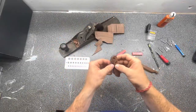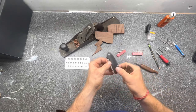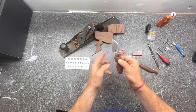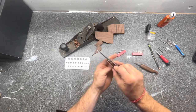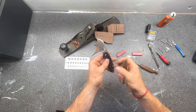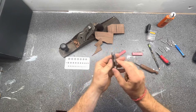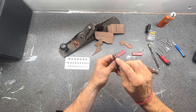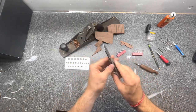Moving forward, I got a little bored and went ahead and heat treated and sanded some grain into the stainless steel scales — kind of like it. The push button lock release idea worked, so the walnut did its job. The lock bar hole was a little too weak and started moving — it's filled with epoxy now, so I might come back and try that again. I'm waiting on some stainless steel welding rod, maybe wire depending on whether I use MIG or arc, so I can extend the tab and make a flipper tab for it.